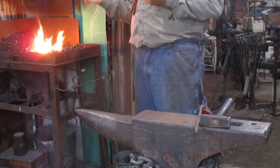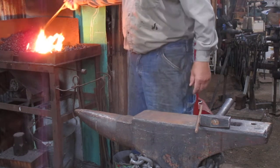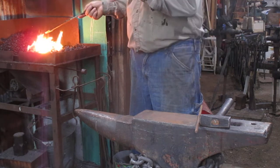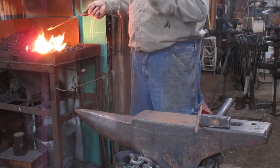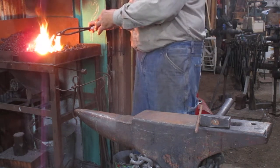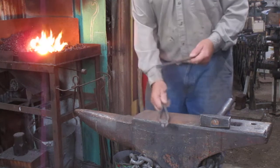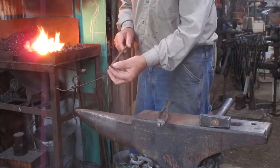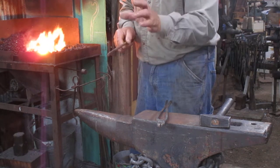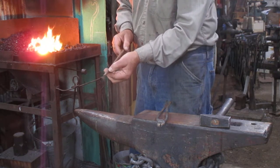You actually only forge in coke, but you need coal in order to make coke. In the forge I've divided the fire into basically three materials: I've got green coal or raw coal over here; I have coal that's coking over — burning off the volatiles to make it into coke — happening here in the fire where I'll be doing my work; and over here I've got all my coke from the last time I used this forge, which I'll use to feed the fire to maintain forging temperatures. The first thing I will do is put a taper on the end of the bar — a little triangular point on the tip, which will be the top of the leaf. Then somewhere below that taper I will put in a fuller on the edge of my anvil, and that fuller is a dent that's going to isolate the material that will be used in actually forging the leaf.